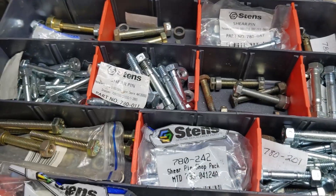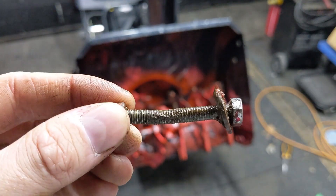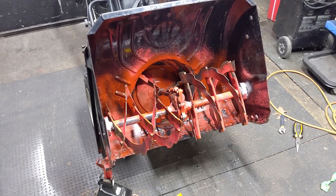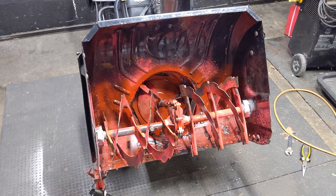That's pretty much everything you need to know about shear pins and shear bolts. Don't run normal bolts — I showed you what can happen to a gearbox when you don't run proper shear bolts that are slightly loose with just a little rotation to them. Use the proper shear bolts and don't over-tighten them. Put your model number into Google followed by 'parts diagram' and you can get the correct part number for your shear pins or shear bolts, so you'll be running the proper ones and won't risk damaging a gearbox if you hit ice or a rock from your driveway.